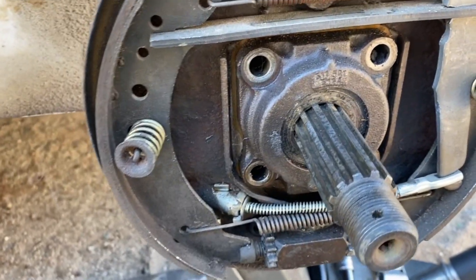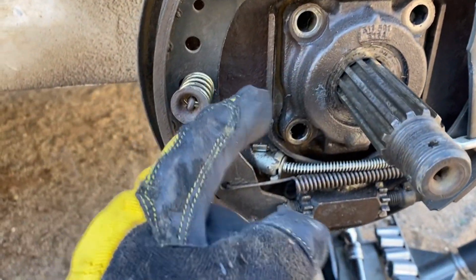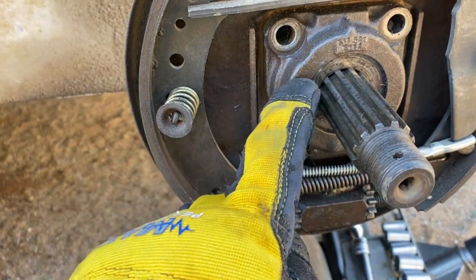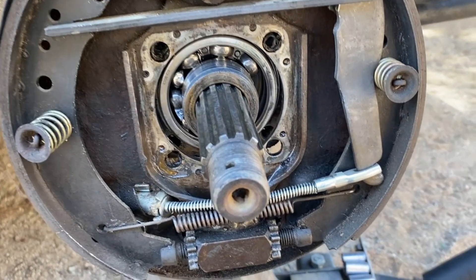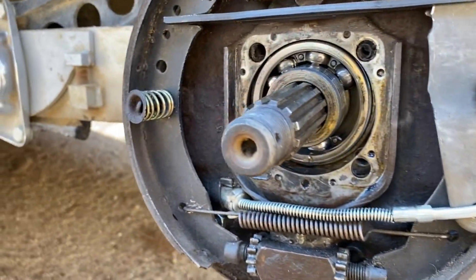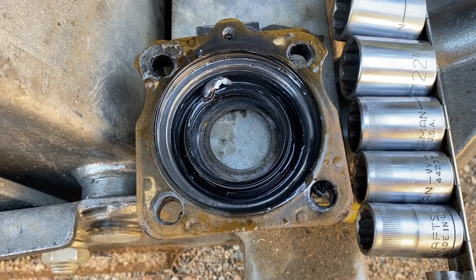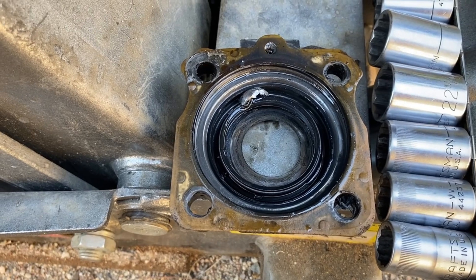Got the bolts out. Notice the orientation of this before I remove it — this goes up, it's got this little bump right here that goes up, and it also has these little areas where it necks down near the bottom. I've removed that cover and as you can see, the cage on this ball bearing is bent and coming apart. If you look inside the casing, there's a piece of that cage wedged in that broke the seal — that's what's causing the leak. So I'm going to have to replace the bearing as well as the seals.